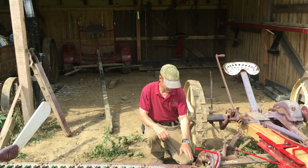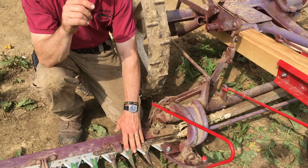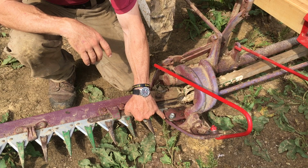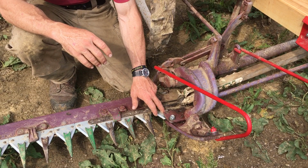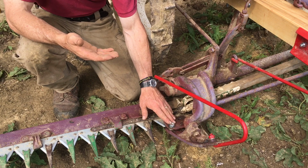One thing I figured out, and thanks a lot Norm McNair and Steve Hoover for helping me out, this plate right here, this ledger plate, was not in there. And so this section, the last section, had no shear plate to cut against, and so it wasn't cutting at all. It was simply pushing the grass out of the way. So now I've got a shear plate in there. Hopefully that's going to work well. I had to pick up that hold down plate a little bit.